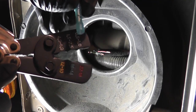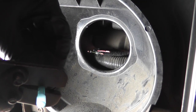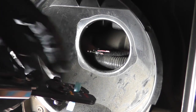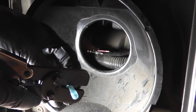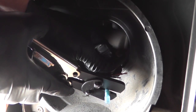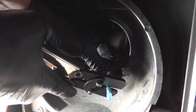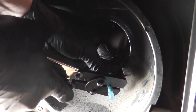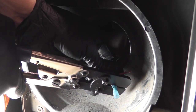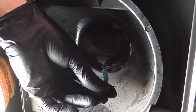What I like to do is insert the terminal into the crimping tool first — it makes it easier, especially in tight quarters like this. I just inserted it and pressed down on the handle just enough to engage the ratchet. With it in the tool, I'm then going to insert the wire into the connector. Push it in until it bottoms out. Once it's bottomed out, just squeeze the handle, and when you squeeze it past a certain point it will release. And that's one half crimped.